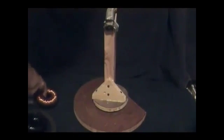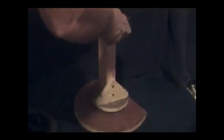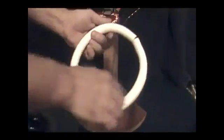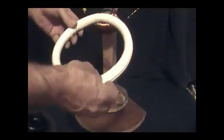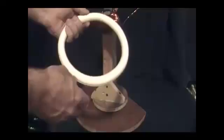This is a little jig I built to wind smaller current transformers. I just have a clamp on the top of it here, and I clamp the current transformer there and then I can wind it. I made this device to thread the magnet wire on — I put it in the center of the current transformer and wind the wire onto it. I made this out of a piece of PVC pipe that I put in the oven, got soft, bent it in a circle, and then slid into it so I could wrap a lot of wire around it. It saves me from having to do as many splices.